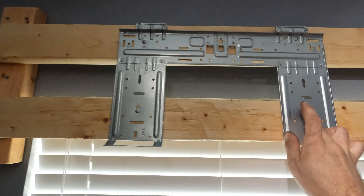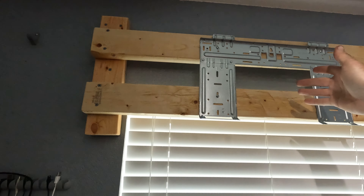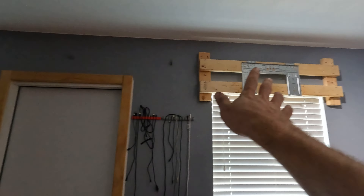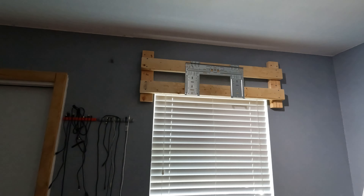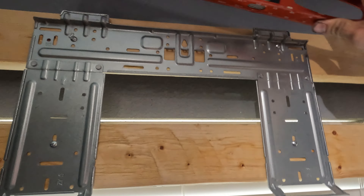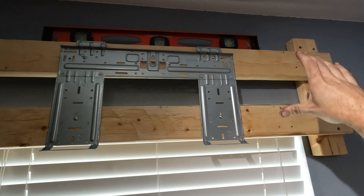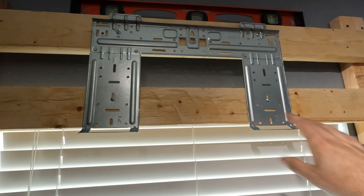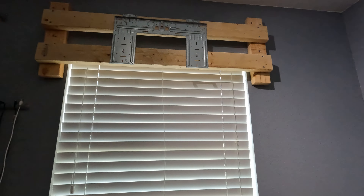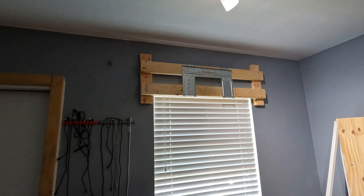The indoor unit bracket is mounted — kind of temporary but it's going to become permanent. I'm going to paint it to make it look a lot better. When you go to mount your indoor unit, you should put a little bit of an angle on it — basically the entire head unit cassette is going to be sagging a little bit more on one side. What that does is facilitate better drainage of the condensate pan. I do that on all my mini splits and it seems to work great — no problems with water stagnating in the condensate pan and growing mold. Now I'm going to hang the indoor unit up there.